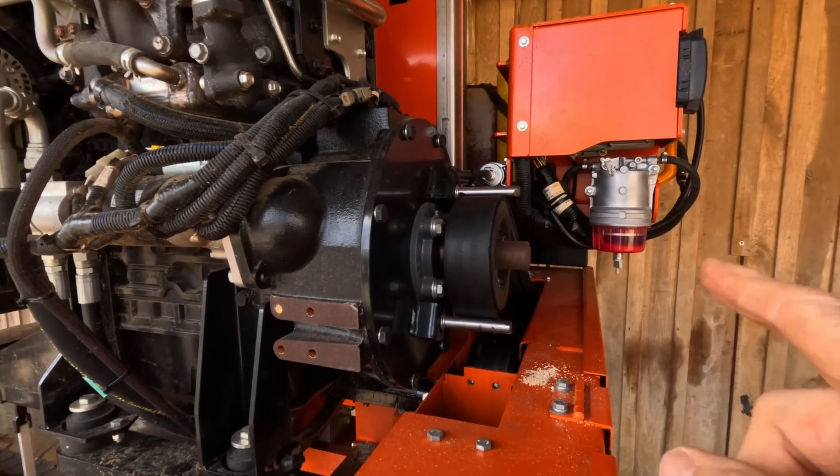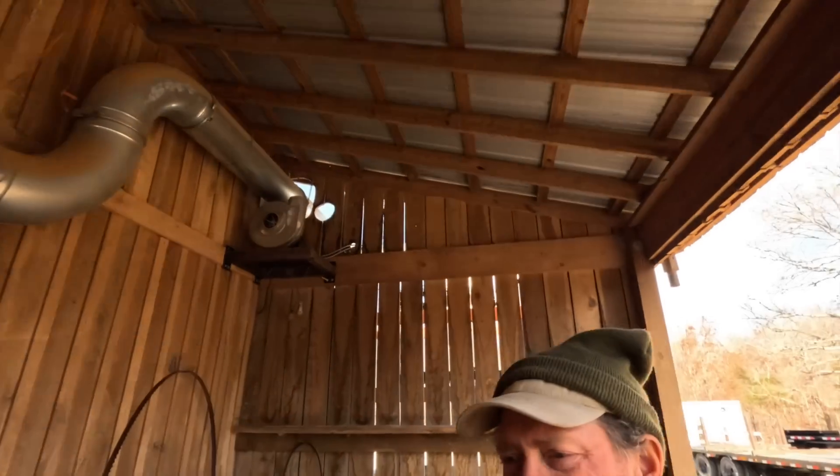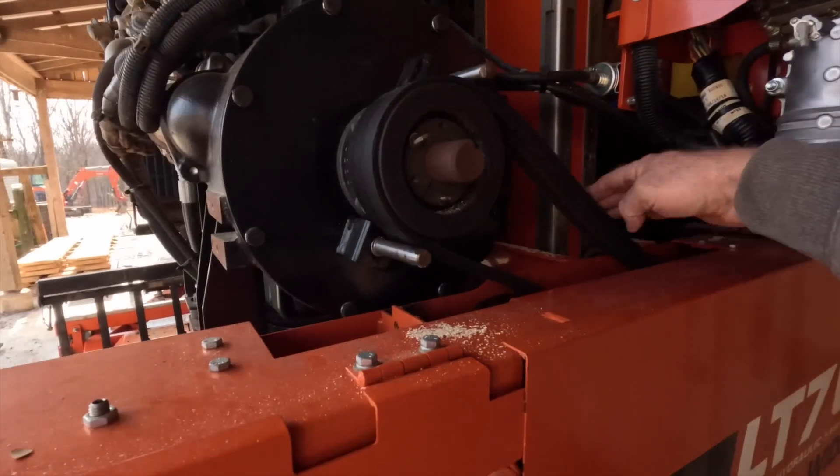Let's say that you do not have a belt tensioning gauge — and if you don't, you need to get one. If you don't have one, your typical way to check a belt is to go up there and thump on it. Now this one's loose, obviously, and you go, yeah, that feels about right, and you just go about your business. That's not how you check a main drive belt. On a sawmill these things are critical to performance. I cannot overstate how important your drive belt tension is, especially if you have a powered feed on your mill.